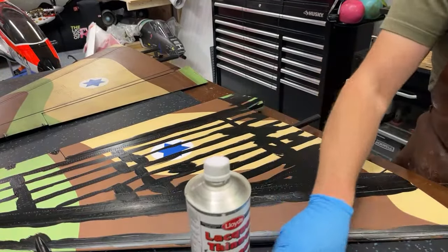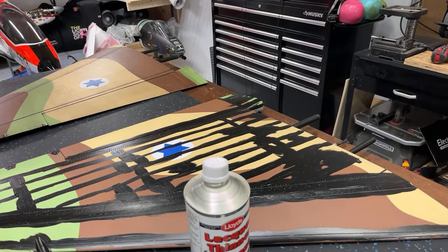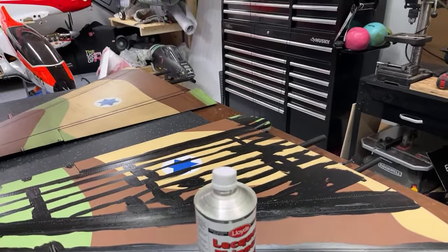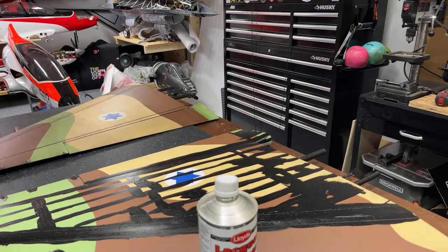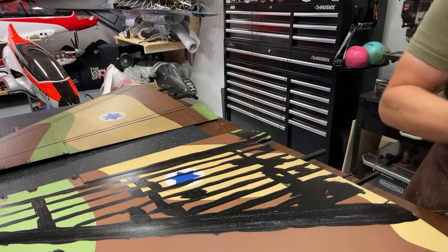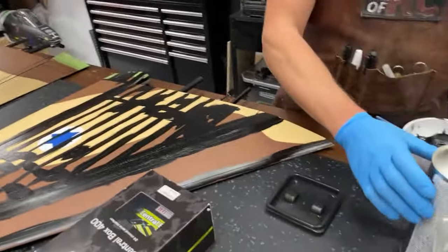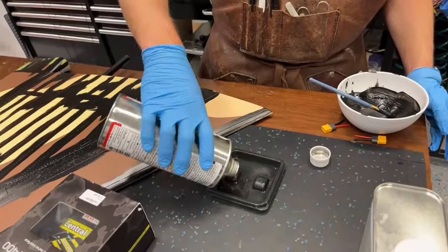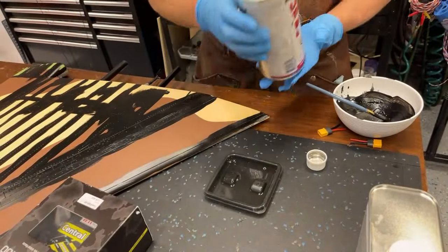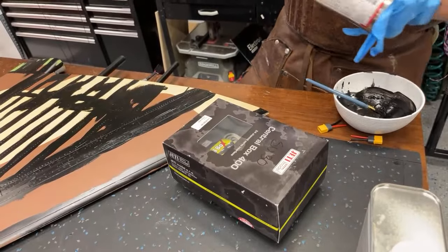We start to get ready with the wiper, the lacquer thinner. Do you use shop towels? Just blue towels. Summer's not here yet. We've been fighting with snow. So when I do this, I like to have a container, and I put our lacquer thinner in there. Because it evaporates so quickly, you want to cover it. That helps. Otherwise, in a few minutes, it'll be gone.